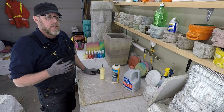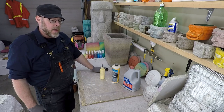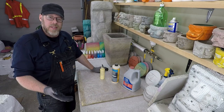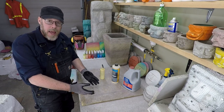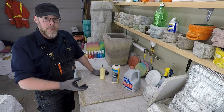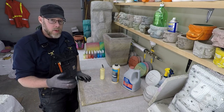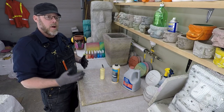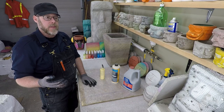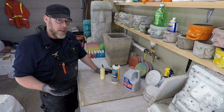It also helps to increase the resistance to water permeation, and that's important in the world of concrete for a number of different reasons. Water permeation could be responsible for a stain on concrete — if you've ever seen a big stain, it could be that you left something metal sitting on top of the concrete and it left a big rust stain. That happens because the concrete is porous and it's absorbing water, and as it absorbs water it's absorbing the stain as well. When you add glue to a concrete mix, it's going to help the concrete resist water absorbing in through the surface.